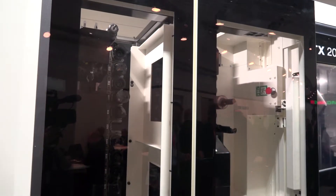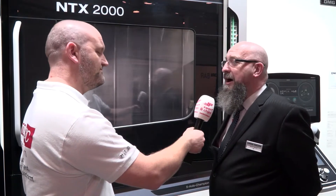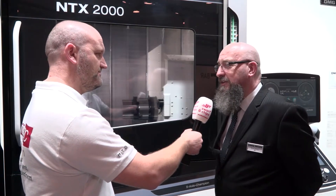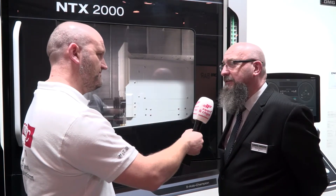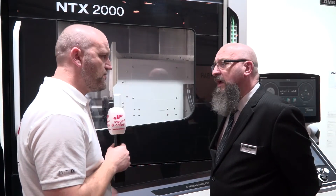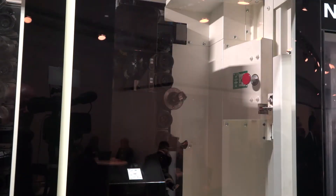Something that you can't get a good surface finish where the customer won't accept a milled surface and it has to be turned — that function is available throughout this range of machines. That's not a standard feature, that's something you have to spec at time of purchase? Well actually, as soon as you get the machine, the principle behind it's there — all it is is software to allow you to do it.